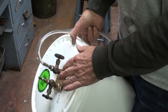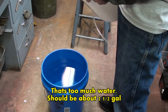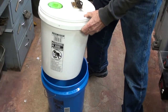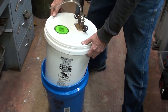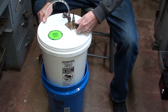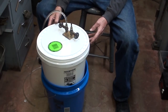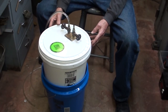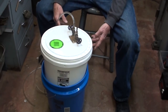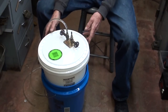The valves are working well and sealing — I always check my valves by sucking on them to tell whether they're leaking. We've got about four and a half gallons of water in here. Since both valves are closed, if the seal isn't leaking this should not go down much. I'll open this valve. Can you see it going down? Just like a real gasometer would. I can see I'll need some kind of stability, because this is just floating around. These are small valves with a minor orifice, but you can see it is going down.